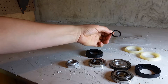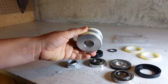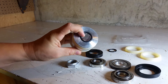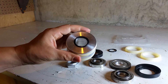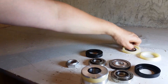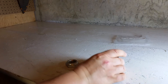These are the only three piston seals. What's actually going on is they have what we call the old style Quaker piston, and what they have to do is replace it with the new style Quaker piston. This is a single aluminum piece and it comes with the seals already assembled on it. It will work just fine with the old style cylinder — the Super K or the K5 cylinders — as long as you're getting the right size, in this case two and a half inch. Basically this new piston replaces all of the old pieces, so you won't be using the new seals for the piston that came in the kit.